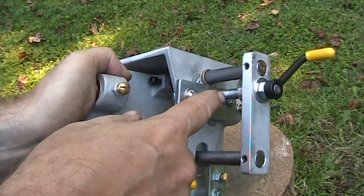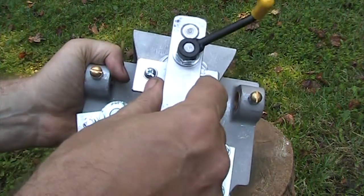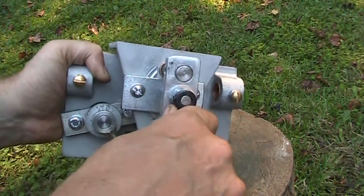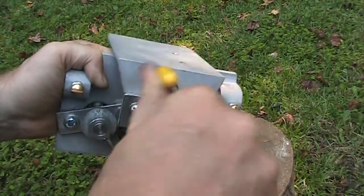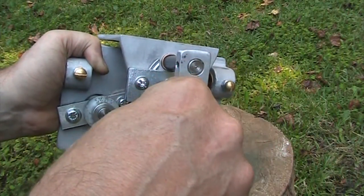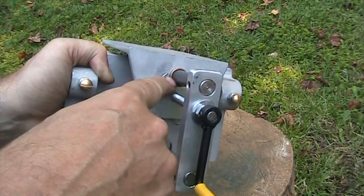In the event that this steel rod wears out, these are cheap — you can buy them at a hardware store for almost nothing. Also, the hole on the original is a little bit too large. Sometimes this will catch a little bit on the inside, but the disadvantage is when you have a bigger hole than three-eighths it goes up and down when you turn it, and that develops more slop and wear on the hole in the aluminum.